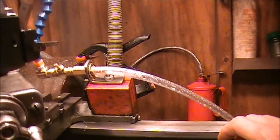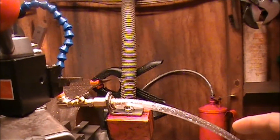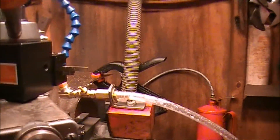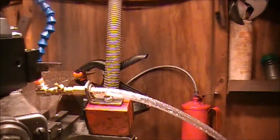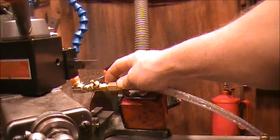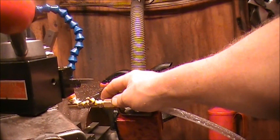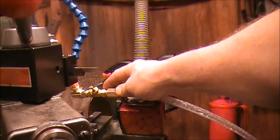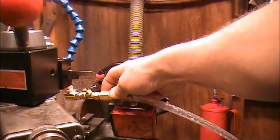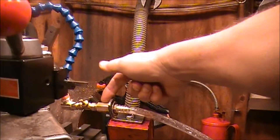What I did — I took a small pipe thread tap that was close to the same size, I believe it's a one-eighth something. It threaded right up on there — it cut new threads right over top of the old threads and basically wiped the old threads out as it was doing it, because it's just brass, and cut a really nice thread on there. So I cut a thread on both ends, then put a reducer on there to step it up to this coupling right here.